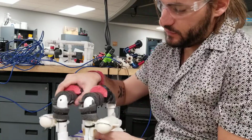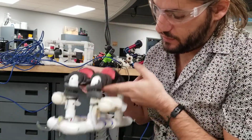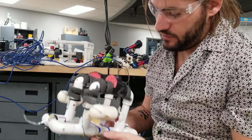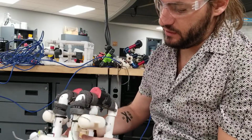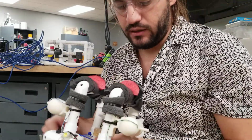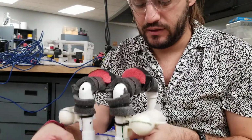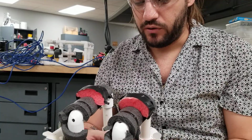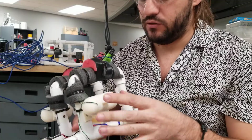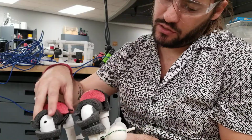But the great thing is when you're putting a Seaperch in the water, you've got to think it's not going to affect gravity. So the center of gravity on this, if I was to hold it right here, maybe it's right here. But in the water, it's going to change because this metal on the motor is going to weigh down heavier than this PVC. So they've designed this one such that it has a similar center of balance that it would in the air, but you've got to position your flotations.